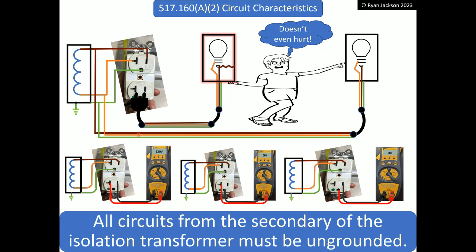Let's measure voltage. On the bottom left we've got the receptacle — brown wire on one side, orange wire on the other. The voltage between brown and orange is 120 volts. So you plug in your meter to what you'd think is hot and neutral, and you get 120 — just like a regular receptacle. But here's where it gets strange: when I measure from the equipment grounding terminal to the silver screw, or from the equipment grounding terminal to the brass screw, either way I get zero volts. There is no voltage there — because there's no circuit.